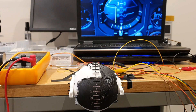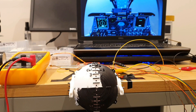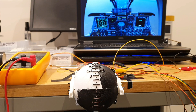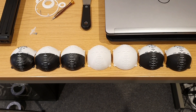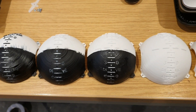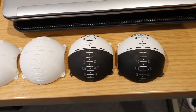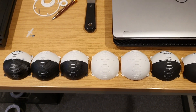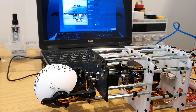While spending time configuring the movement to get the best result, I can also turn my attention to the way I'm going to paint the surface of the sphere. Because it is my plan to also have back-lighting — not just a floodlight on the front of the sphere, but to actually illuminate it from within. So I need the white PLA to transmit the light, but equally the parts painted in black will block it. I spend a fair bit of time printing different revisions of the sphere and trying different painting methods — each print being around three and a half hours, which is into 24 hours of solid print time. But it's well worth that time to arrive at something more aesthetic. We're now at a point to pull together all these aspects of the sphere's development into a testbed, and this is what I've arrived at.